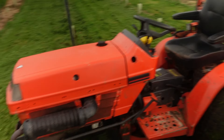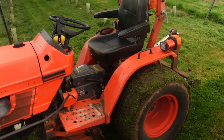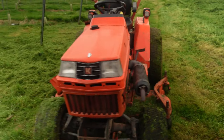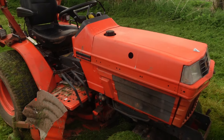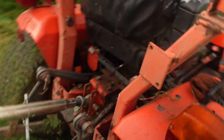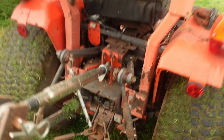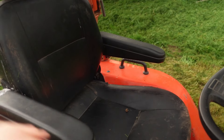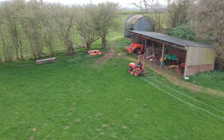Time to put the tractor to bed - it's done its job for today. This tractor, just in case you're wondering, is a Kubota B1750. I got this one off eBay and it's been fantastic - I probably use it more than anything else. It's not particularly powerful - only 17 horsepower - with a mower deck underneath. The really nice thing is on the back it's got a three-point hitch and a PTO which you can attach various farm implements to. Also, this is just a mobility scooter chair I put on because the other one was completely worn out - I modified it a little bit.